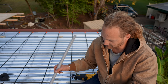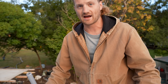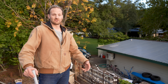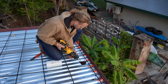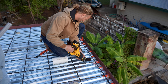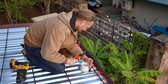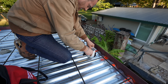The hole's in — just making some adjustments to the conduit. That's for the power. The other item: we will have a little patio bar up here with a grill, a sink, and a little refrigerator. Our plumbers have everything roughed in below, but they needed what we call a sleeve through the deck to pass their sanitary line through. So when you wash your hands, your wastewater has a place to go. We use sleeves in decks a lot to indicate where things can go in the future, even if it's not permanent right now.